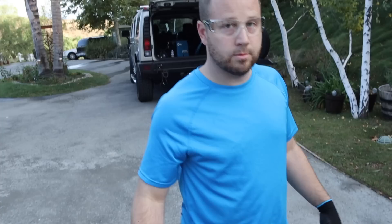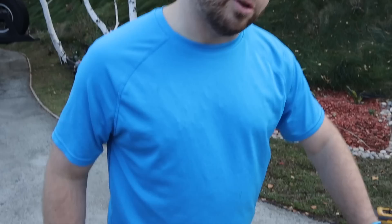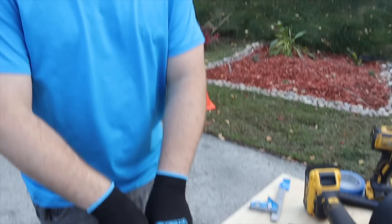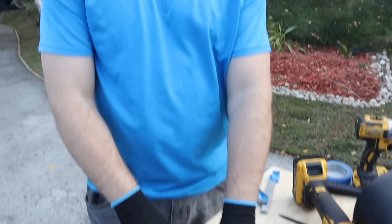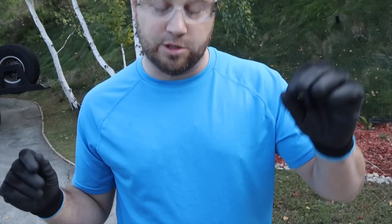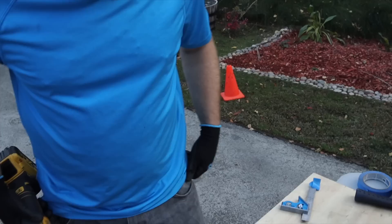Here it is — the tube came through the other side. We're at weld prep. We've marked out lines where we need to grind off the mill scale. Mill scale only takes a very very minute amount to interrupt the interface between weld, parent material, and filler material. Just a couple molecules thick at the weld-trailer hitch-trailer interface is enough to disrupt that fusion — and we lose a hundred percent of the weld strength we should have. So we grind it all off, get it to bare metal. A welder will always say 'bare metal' — like this section, beautiful, shiny and pristine. Then we're ready for welding.